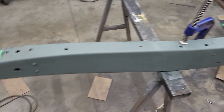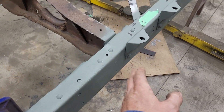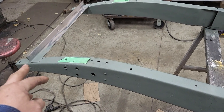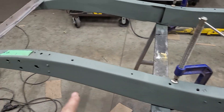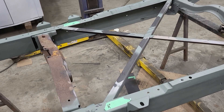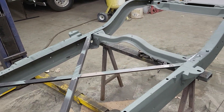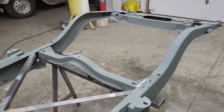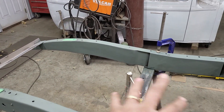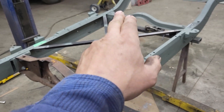I measured from the front of the frame back, knowing this is a punched-out section so I might have a little margin of error, but it was a set of checks all the way down. Knowing that if I was a little bit off all the way down but got a consistent distance all the way down, then I came to this hole and measured and so on. Just to make sure I had confidence in the hole locations. Then I began doing a series of cross measurements to identify what I needed to do to straighten the frame out, because I was using one reference point all along.